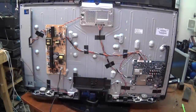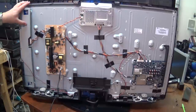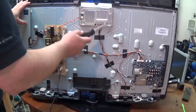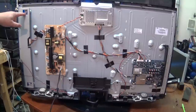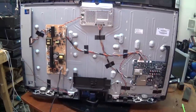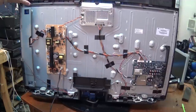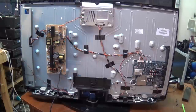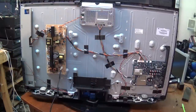We've identified the components on the inside of this Sony TV. We have the power supply, a lamp driver assembly, and the ballast assembly for the fluorescent lamps. Over here we have the main signal board, and up here we have the timing control, or T-Con board. Interestingly, right on this power supply board it says Samsung — because Samsung made the actual glass panel for this generation of Sony LCD television. Sony did make the other components such as the power supply and the main signal board.